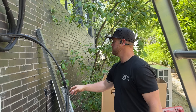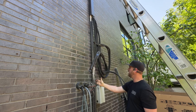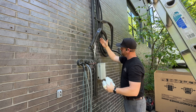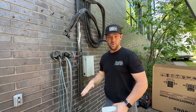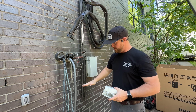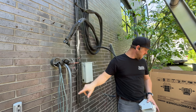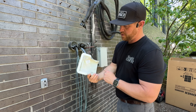On this four inch speedy channel that they already have, where it ends right there - if I come straight down it's going to hit the box, so I need to offset it. I'm thinking about using two 45s like this so I can continue it all the way down. I usually like to run the line hide just below the top of the unit so you can't see any piping from above. The unit comes down and then it stops. That's what I'm thinking about doing to continue that four inch.